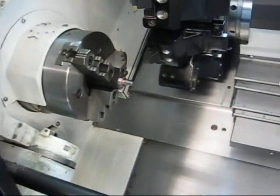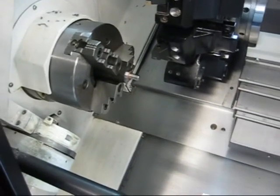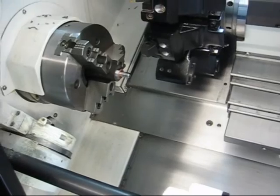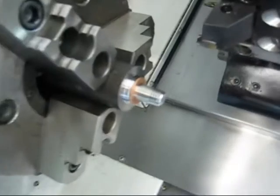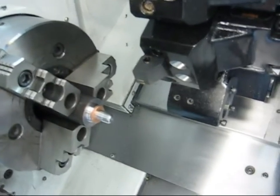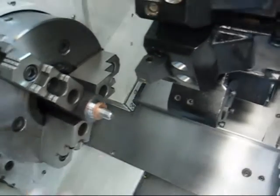I'm going to modify some washers for the bolt that holds the apron to the carriage. I couldn't find the right size, so I'm going to modify some of the ones I bought. I've machined this part here now, and I'll put the washers on like so, and then I'll turn the outside to the correct diameter — I think it's about 19 and a half millimeters. That will be a good fit.